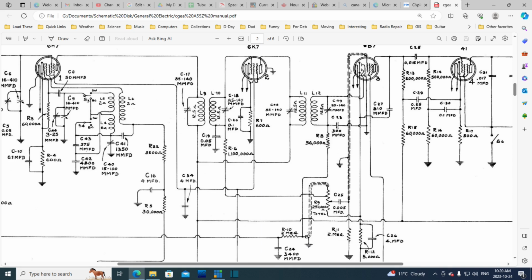Okay, now we'll follow the audio. So what's happening here now is we've got the rectified IF output here. The RF has been dumped to ground through this capacitor, and this resistor is making it attractive for the signal to go this way, but DC can't go that way, so it's going to go through the resistor. Now the audio is part of this DC here. I guess that's the best way I can say it. Or the variations in the DC here are generating an audio signal. This capacitor will drop the DC component but carry the AC onward.